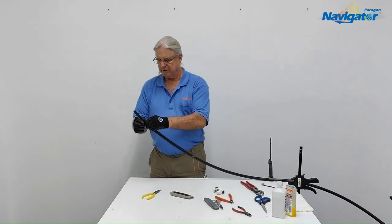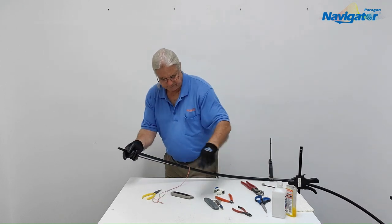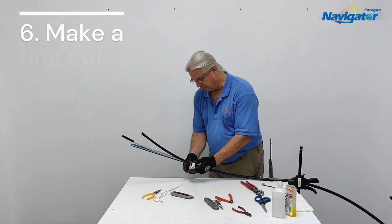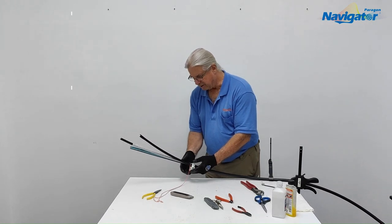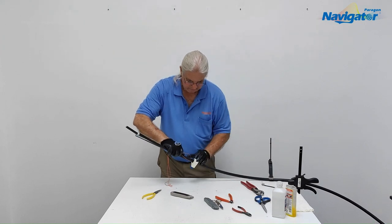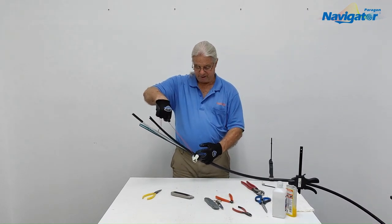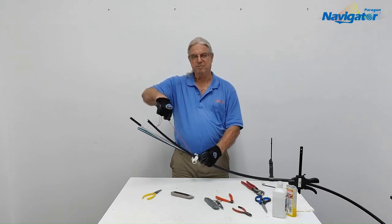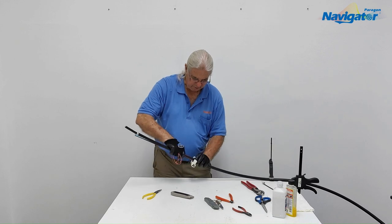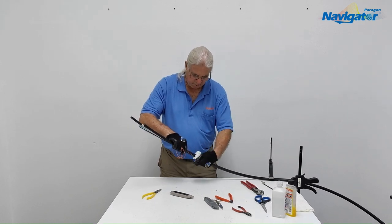Now we've got the strings pulled and we're pulling away the first layer of armor. Usually this is your actual ring cut on your cable — this is the cut where you have to be very careful not to damage anything below. I usually wait until I have the cable most of the way open all the way down, and my strings are above the ring cut. I'm going to pull the strings through the cut to create an open space on the armor to attach the ground strap. With a double armored cable, you technically need by code to provide a ground strap for both armors in the cable.